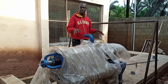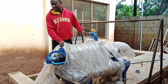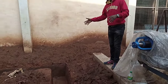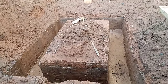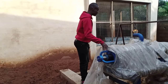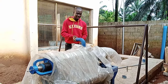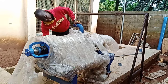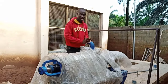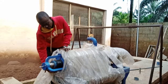This is the manure drying machine. This is a new one — we have not opened it yet, it is wrapped because of water. The manure dryer itself needs to be on a shed. This is the foundation of the shed. After doing the foundation, we put in rods, then do the zinc roofing. We then move the manure dryer and put it here. The manure sucker sucks the manure dryer into this place. This is called the sucker inlet, this is called the return, and there is another pipe called the outlet. When the machine is sucking the manure, it processes and gives you the organic manure from the outlet.